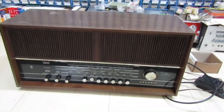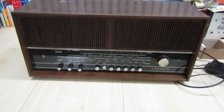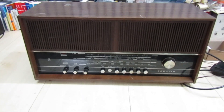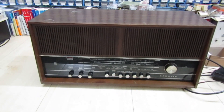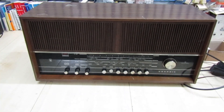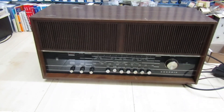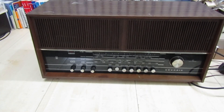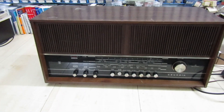Hi guys and girls on YouTube and welcome to my channel. I've got this radio here — one of my viewers spotted it on my workbench and asked if I could make a video about it. I can't tell you much about it because I'm not a big radio expert and this is before my time, but it was sent in for repair and it came on for about five minutes and then the audio output valve started glowing cherry red — that's an ELL80.